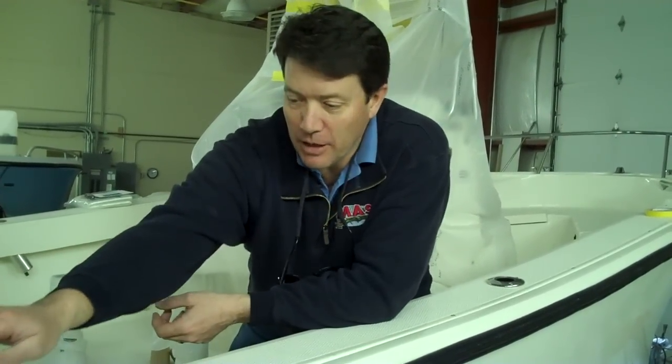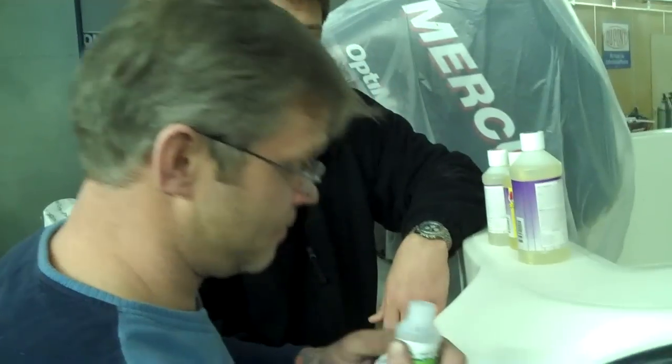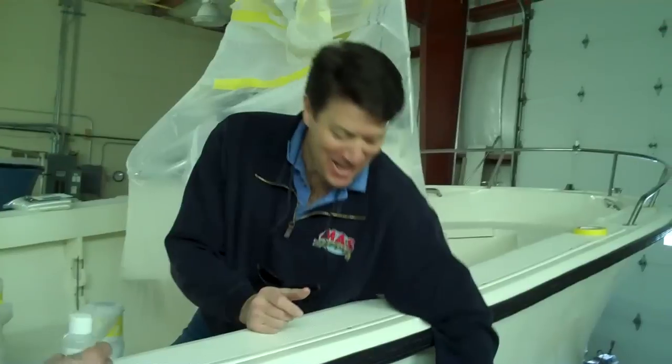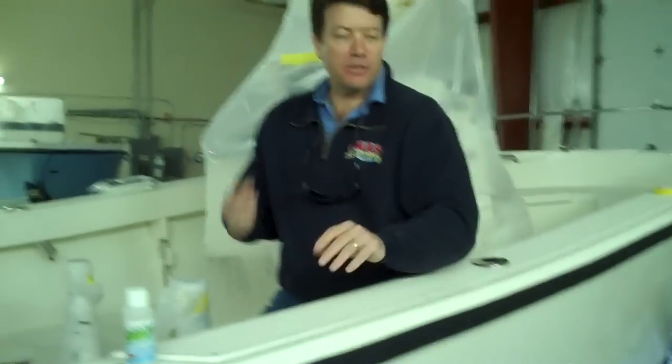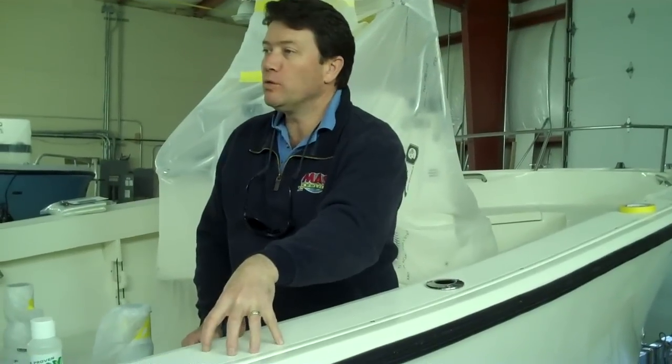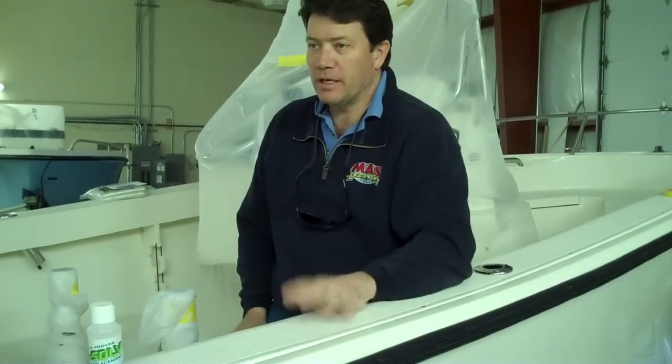You can smell it — it's not that bad. It's not that strong, really. But this will take wax off the boat and scuff lines off as well. If you mix it 50-50 with water and scrub the non-skid, where you see non-skid that has mold and mildew you can't get out, that'll take it out. It'll take that wax off, just like that.